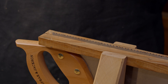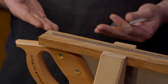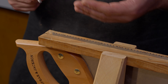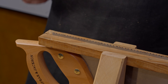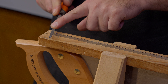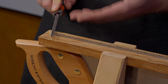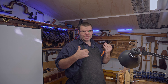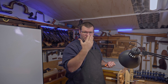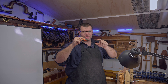The two main terms are the rake — the angle on the front of the cutting tooth — and the fleam, which is the angle we run our file across the saw plate. On a crosscut saw, the fleam is somewhere between 60 and 65 degrees. We're going to use the teeth themselves to match the angle. This saw probably has about a 20-degree negative rake — it's set back from 90 degrees but not all the way to negative 30 degrees where the file would sit flat across the top.